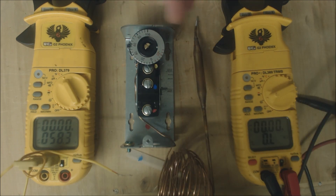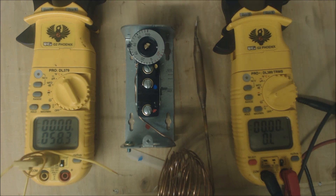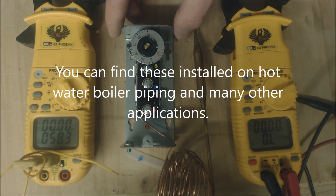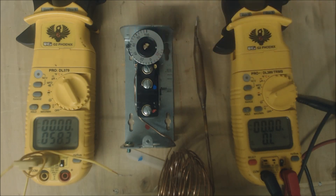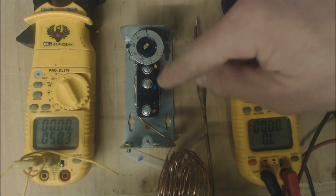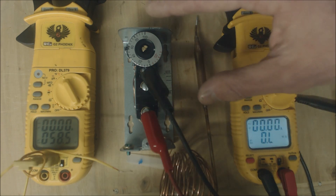You may find these temp controllers in a variety of different applications. You could find them mainly in refrigeration units, but also in heat pumps in the outdoor unit, controlling when the outdoor heat pump turns off and when the fuel gas turns on. You may also find them used in greenhouses to control the heater, because of that three degree temperature swing compared to the 0.7 or 0.9 degree temperature change with standard digital thermostats. So this unit is accurate.